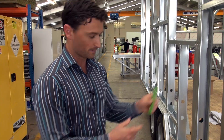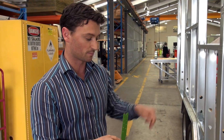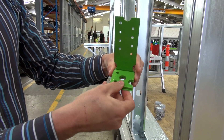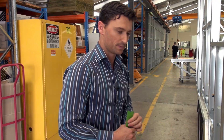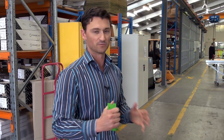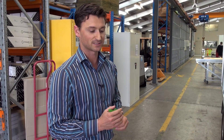We're going to be doing bracing brackets like this, which connects the stud down to the bottom plate and then through into the galvanized C section of the trailer. Because the trailer is moving around, we've got to take into account not only wind zones when it's stationary but also movement from braking and acceleration. So we're really making sure it's bolted down properly and doing a lot more than we would for a standard house.